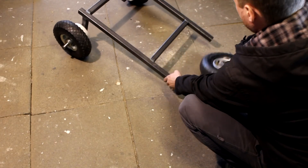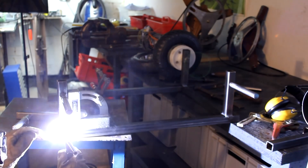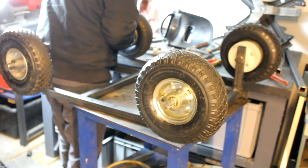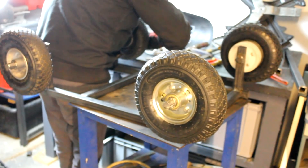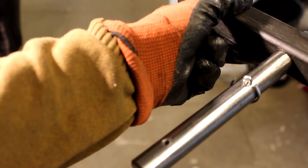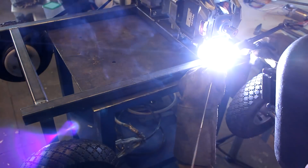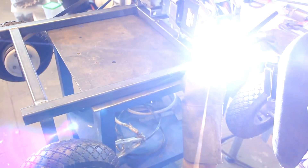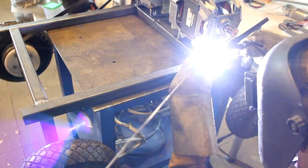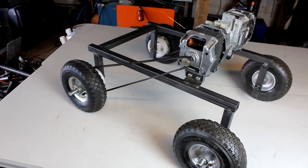The goal is to see if the motors are strong enough and if the belts are sitting tightly enough on the pulleys — that's really the task for today. Steering will be an issue for another episode. With the frame completed so far and the two temporary front axles installed, I put the wheels onto the axles, secured by ordinary split pins. I would now build a mechanism to adjust belt tension, but the steel I ordered for that is not yet here. So I'm also temporarily welding the motors in place onto the frame — I will remove these welds again in a week or so. This has allowed me to also install the belts, connecting the motors with the pulleys on the wheels.